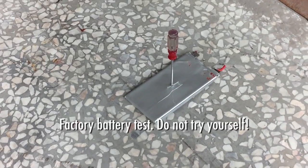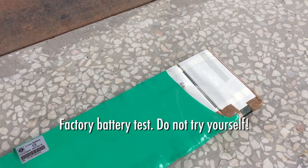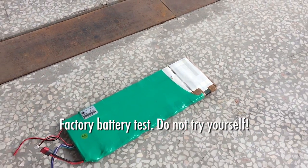We feel it's a much safer option than offering 40 cells with many more solder joints and many opportunities for things to go wrong. We test these battery cells vigorously so we can get international certifications for our batteries across all our markets. Before we launched our GT carbon fiber skateboards, we did test out a bunch of other battery structures and cell types, including the 18650 cell.